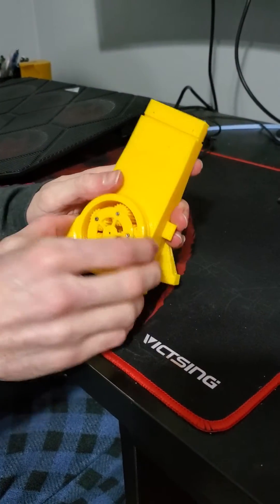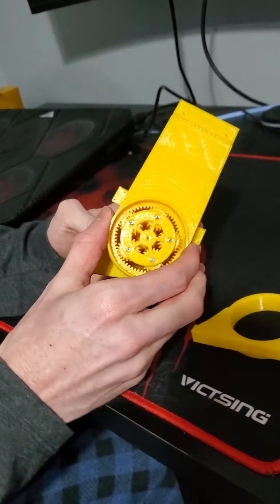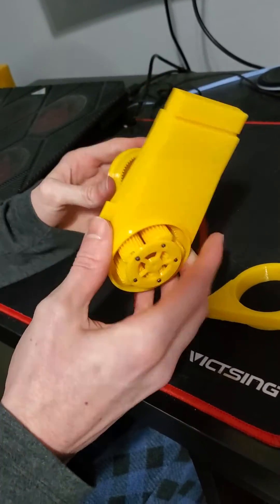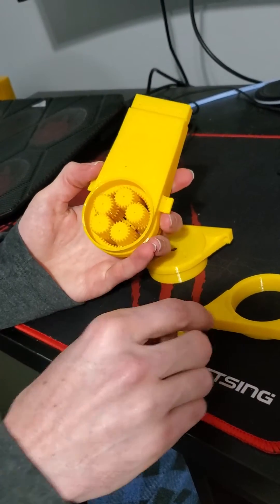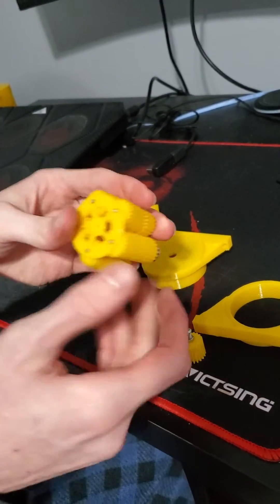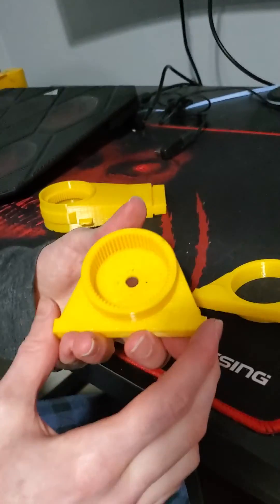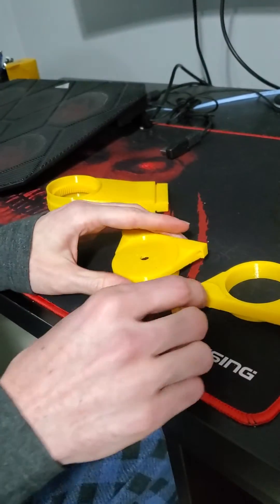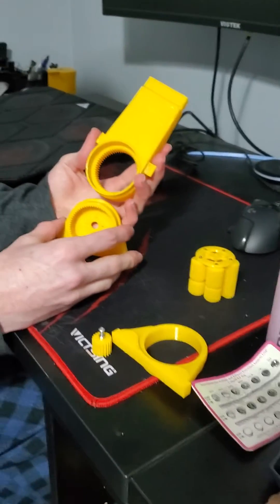Here's how it disassembles. It's got that holder plate. It's got the split ring which is actually the robot arm. It's got the main drive gear here and it's got the set of planet gears here that's held on by this carrier. It's got the internal tooth portion and it all just snaps together and you get a hundred and seventy seven to one.